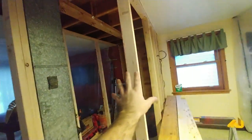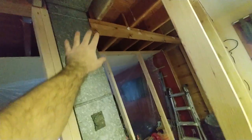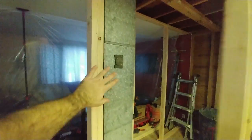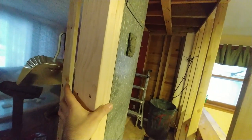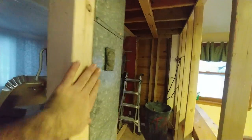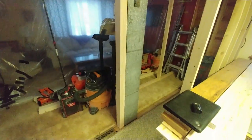Tomorrow we'll finish up this part and take this temporary wall out. There'll be another pair of posts on the other side of the duct, and then I will actually laminate both sides with half-inch plywood. It doesn't matter that it gets an inch greater in size, but I'd like to connect both of these posts and make basically a box beam, which will make it excellent, heavy-duty, and tough.